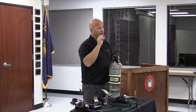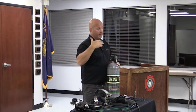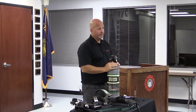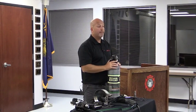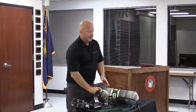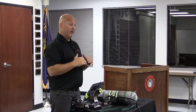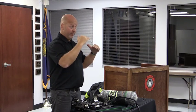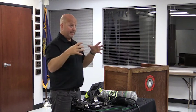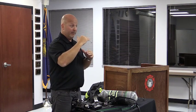The way they rate the cylinders, and I don't remember the liters per minute, I apologize, I should know that, is more or less you sitting like you are right now with an SCBA on, breathing, doing basically nothing. You start elevating your breathing rate, obviously you don't get 45 minutes out of it. But the alarm is going to go off at 30? It is, and way more, for 2 reasons. One, on the new SCBA the low air alarm is set to go off at 33%. Your old ones are set to go off at 25%, so that's more air. And now you've taken a larger capacity cylinder, so you've increased the amount of air available at 1,500 PSI. You follow? Yep.